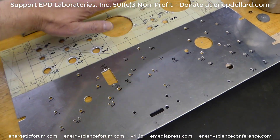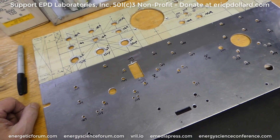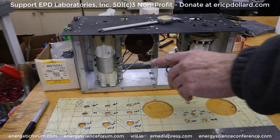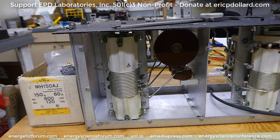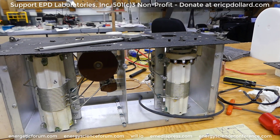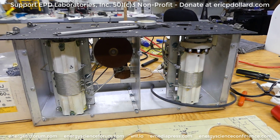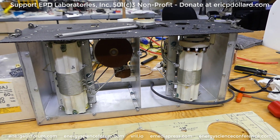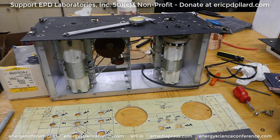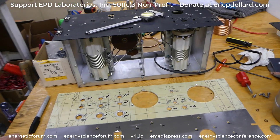This whole thing will be a tuning unit. It's the meters and controls, like turning the plate voltage on and off. The tuning unit has the master oscillator that determines the frequency, and then the power amplifier which amplifies that to about 100 watts. This thing will have about the same power output as the Collins. The frequency won't be as stable because it won't have that precision oscillator, but stability isn't that critical — if that one's ten cycles, this one's a hundred, and anything within a hundred cycles plus or minus is within the stability factor.